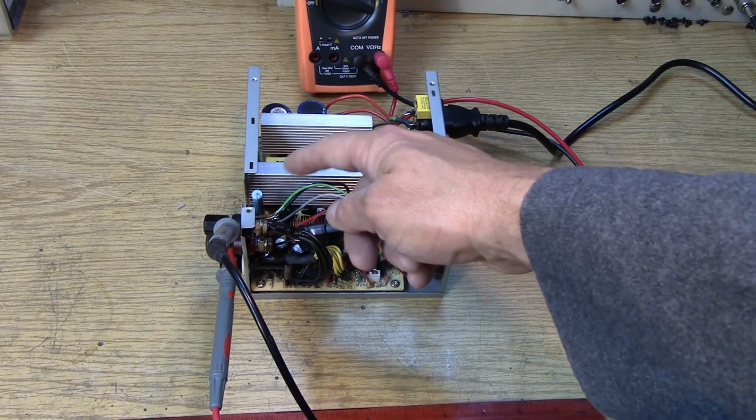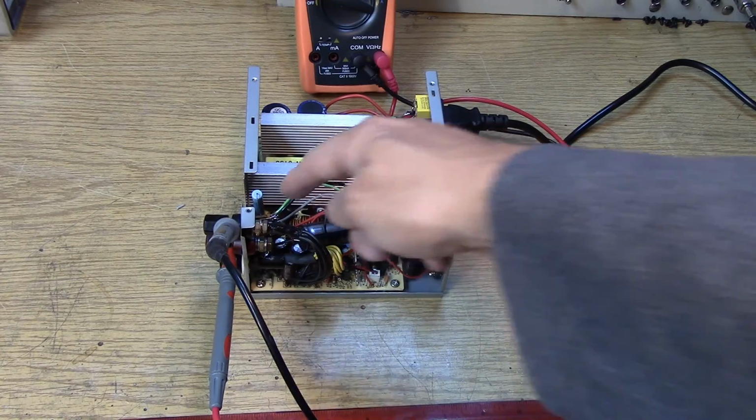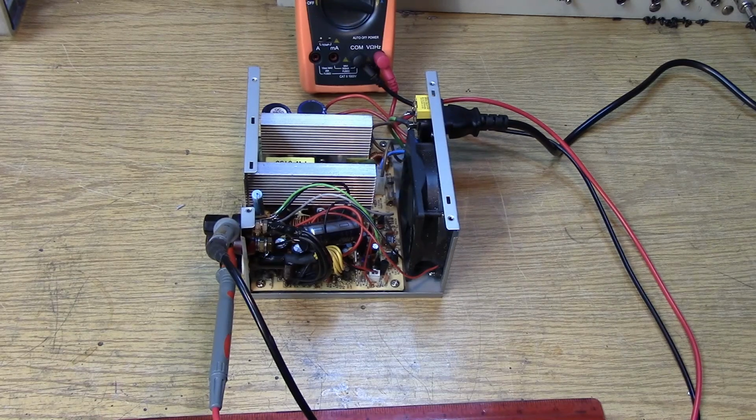The black and the green are shorted together here on this terminal strip. That also is a convenient ground point for the 330 ohm resistor that I'm using as the 5-volt load. Together with the green and black together and the 330 ohm load resistor, that guarantees that the ATX thinks it's talking to a computer and it turns on. That also is a convenient tie point for the LED return, so putting a little terminal strip in there was not a bad idea.